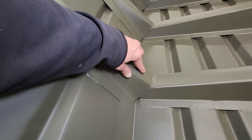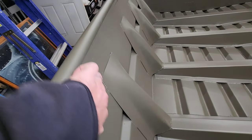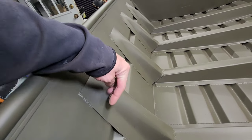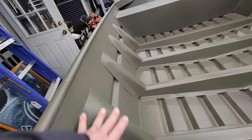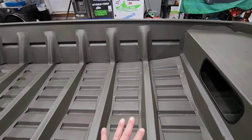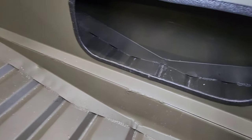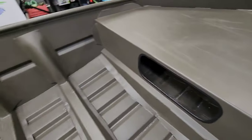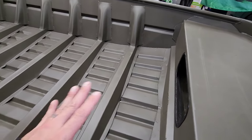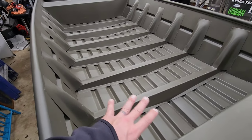You can even see some hammer marks on the side pieces — they hammer these in and shoot some MIG welds over them. The side pieces come up tall but they only have about two inches welded here, so I'll come back, weld another two inches down, cut them off, and hide them up underneath my deck. This small compartment in the front is kind of pointless — you could fit a rope or life jackets in there — but we're going to end up doing away with it. This boat is going to get a rod locker and a whole lot of stuff inside the hull.